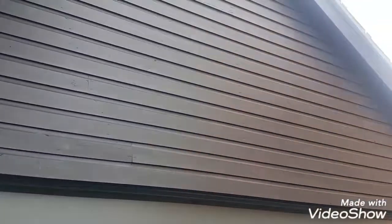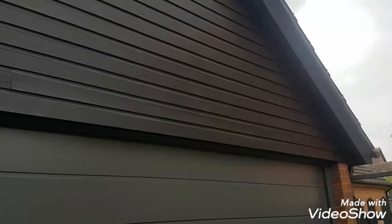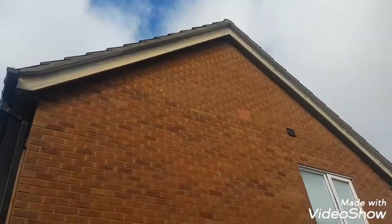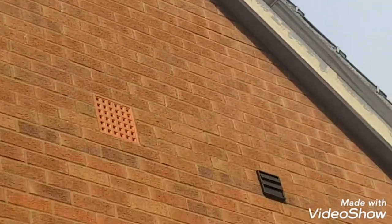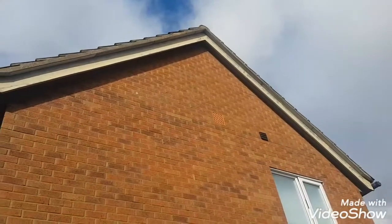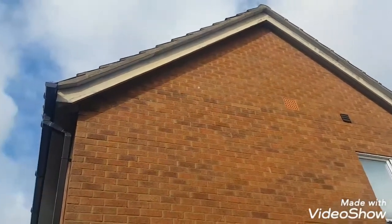For the rest of it — the fascias and soffits — I used Bedec Barn Paint in a black matte finish. This was over Otex Aqua as well, because before it was a horrible stain. I put Otex Aqua on, then filled it with TruPret exterior wood repair, because these fascias and soffits haven't been touched since the early 80s — really dried out and quite rotten. That's filled up and ready to go. Two coats of this matte and we'll get a great finish.